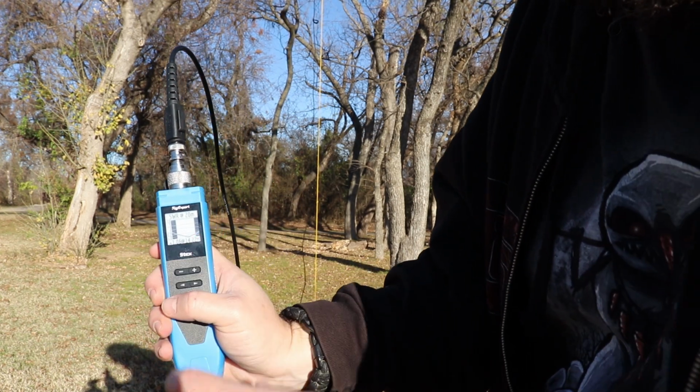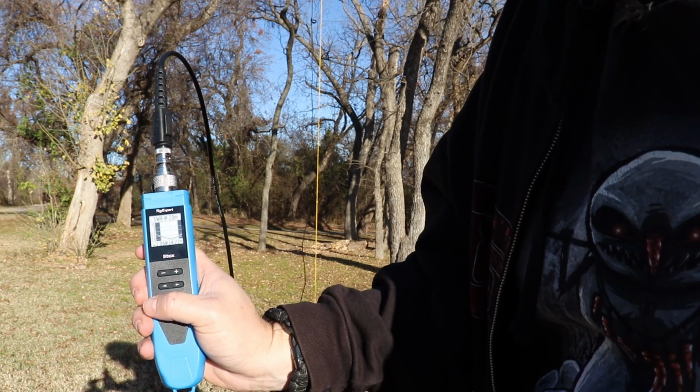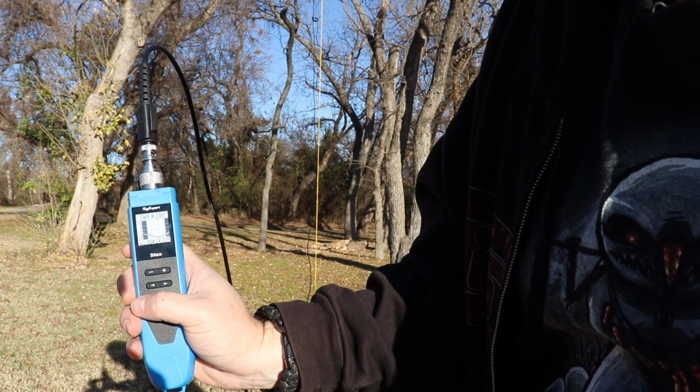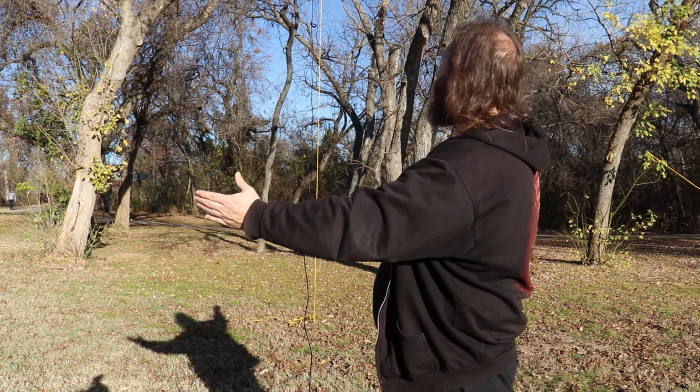You know, I'm going to leave it like this. It's already in the middle of most of the 20-meter band where we use some single sideband. So I'm going to be happy with that. It's a 1.06 at 14.22. Yes! So this is my dipole tuned up.